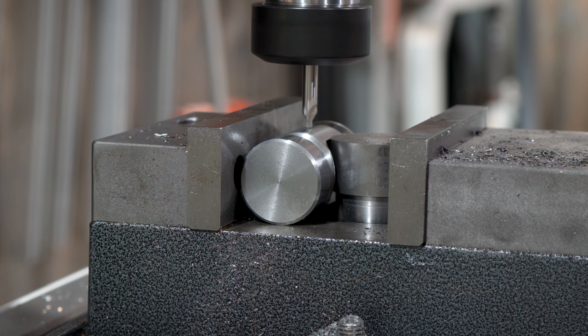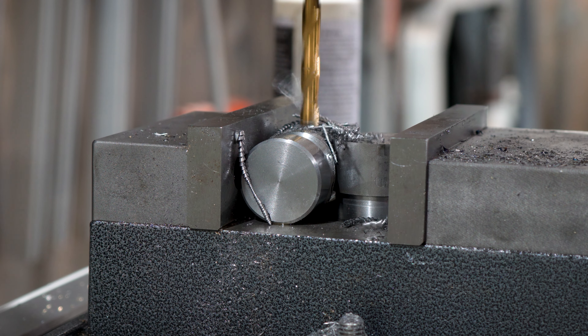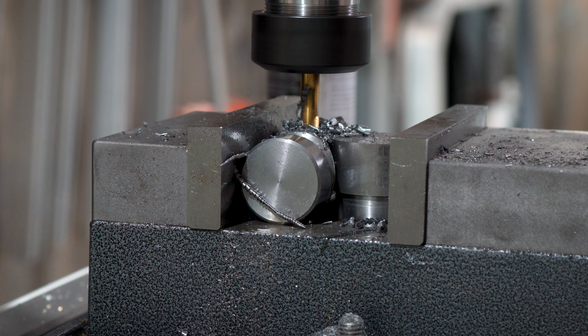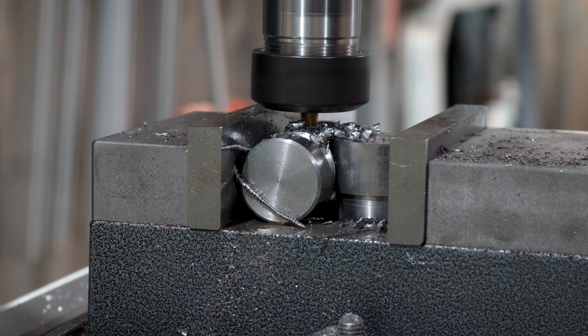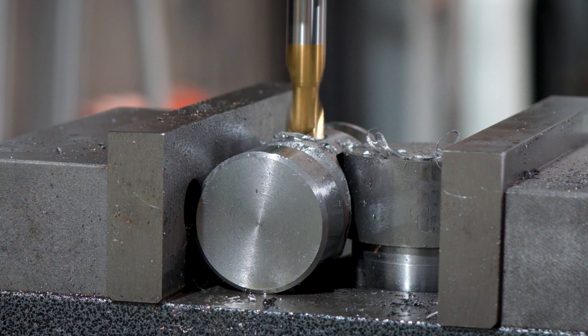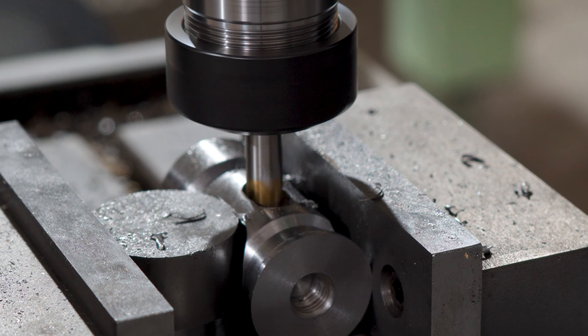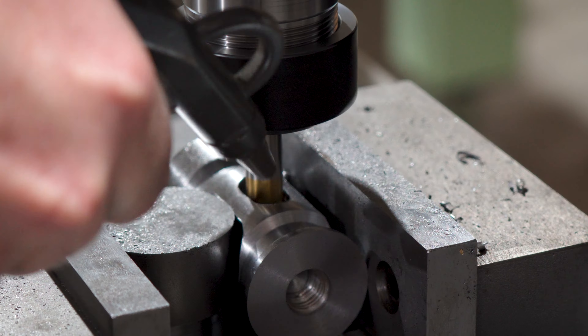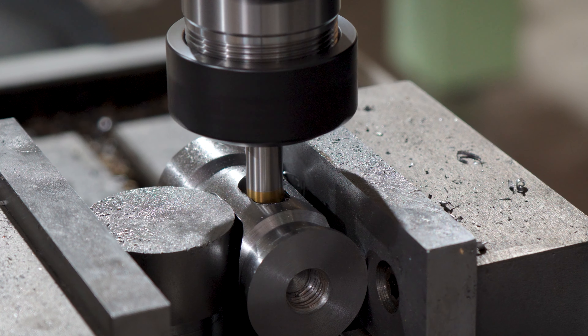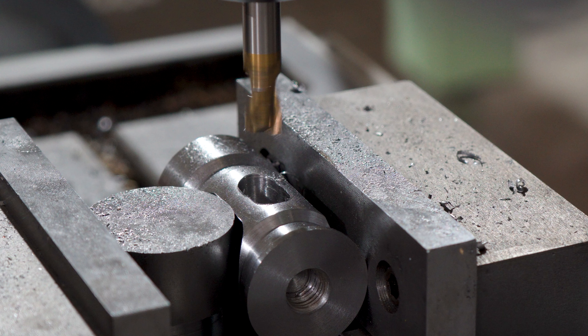Which leads me into mistake number two: I should have cut the eye before milling the sides. This would have been a lot sturdier if the sides were consistent in thickness. As a workaround, using the round-off cut from the bar held firmly against the hammerhead managed to clock this one up straight — well, straight enough for what I'm trying to do. So a little centre drill, followed by a bigger pilot, and we can get to work on this eye. Apparently sharp end mills make this a lot easier. I'll burrow my way through nice and slow with a two-flute end mill until it breaks through onto the other side. That centre hole did a pretty good job of letting the chips fall through as it went.